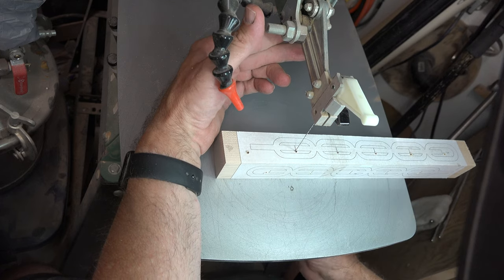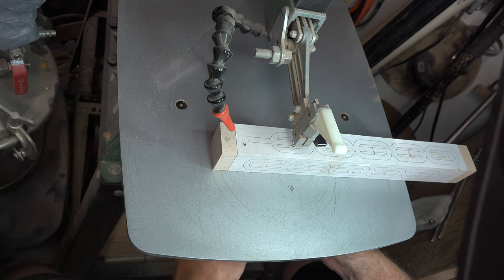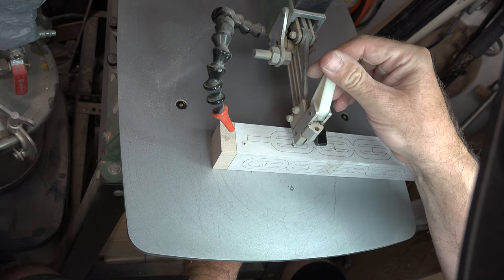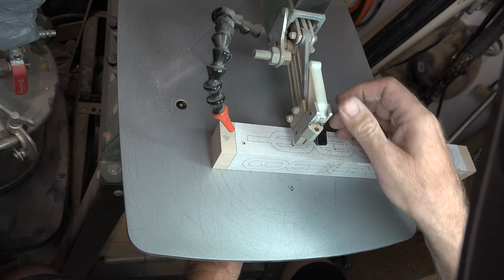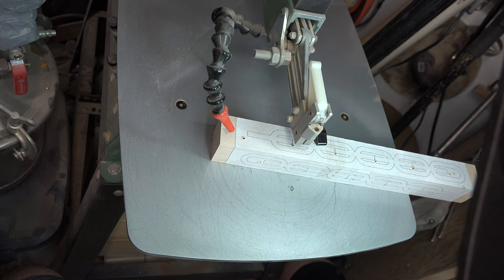I'm using a number 7 PGT blade, which is precision ground tooth, and they do an amazing job of cutting here. Another thing that you want to make sure of for this project is that your blade is square. If you are not sure how to do that, I suggest you check my show on squaring up the scroll saw blade that I posted a few months ago. I'll post a link to that down below in the description, and you can check it out if need be.